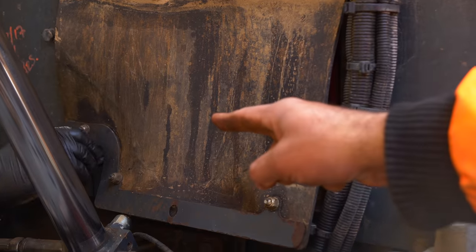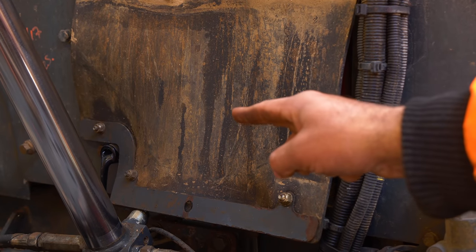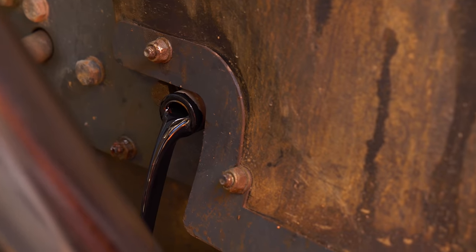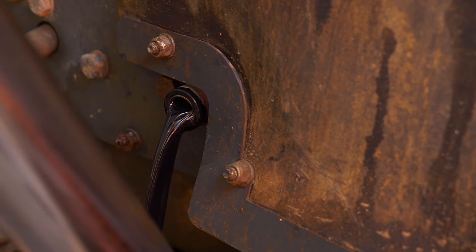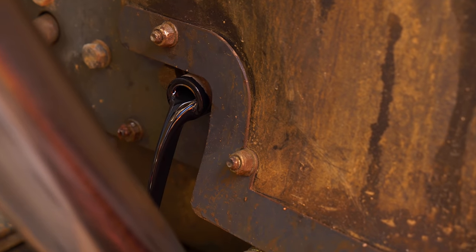Nice and tight. This awkward location here, this is where you bleed all the oil out of the engine, and this takes about 3 hours. That oil is just rancid. It has been a long time since the oil has been changed. It's probably lost all its lubrication and everything, and look at the color of it as well. We definitely needed an oil change of this donkey engine.